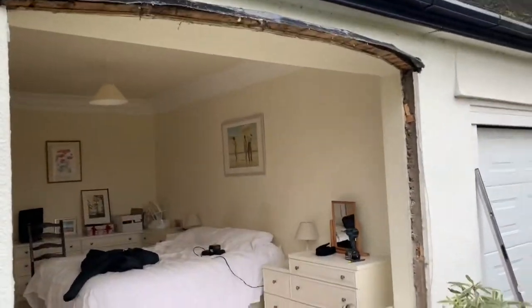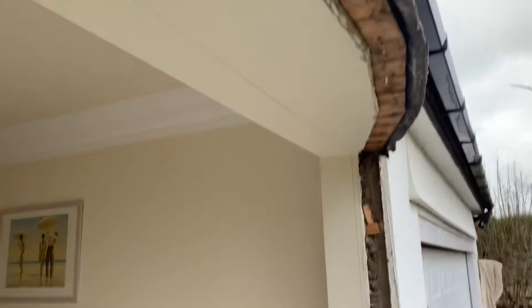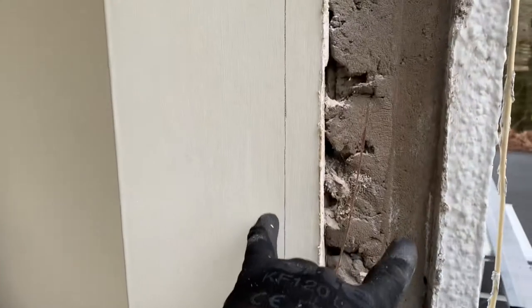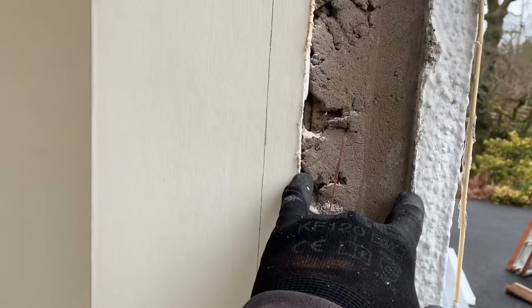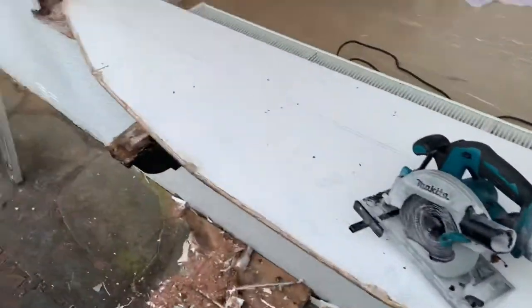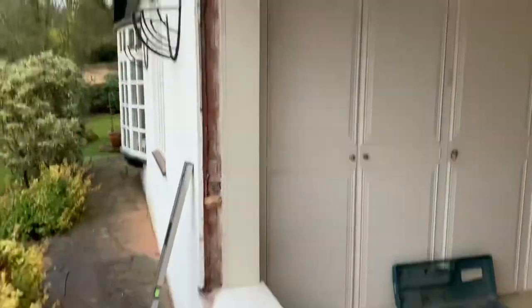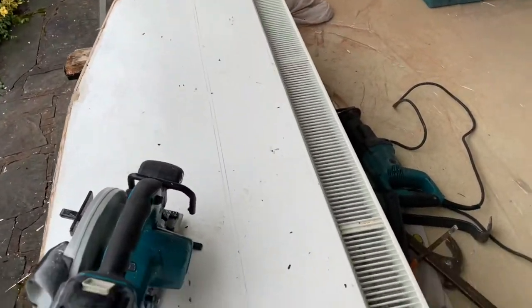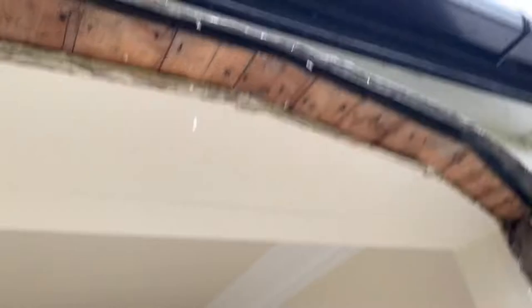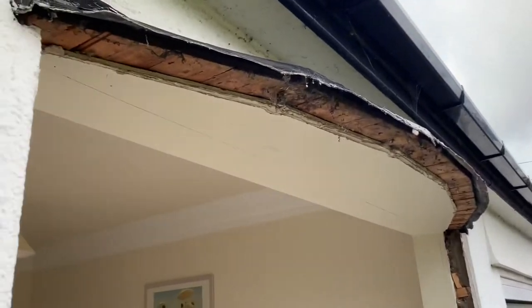Just prepping — just got to cut back for the Residence 9 frame. With the Residence 9 frame being 100mm width versus a typical frame of 70–75mm, the Residence 9 is a bit thicker at 100mm. We're going to have to chop back this plasterwork and also where we've removed the bow window, cut back because we're putting a flat window in now — so it'll just have a normal width sill on the inside. Same old ceiling, get rid of all this lead work, timber cladding on top — take that out.